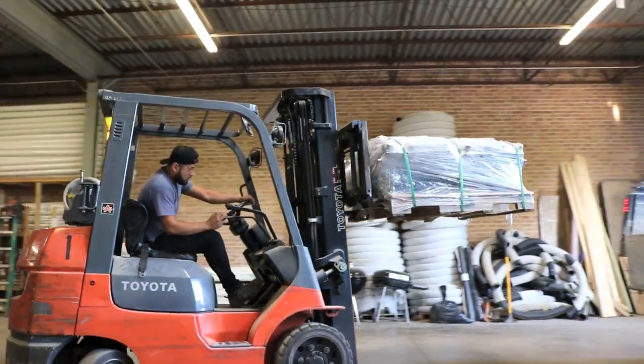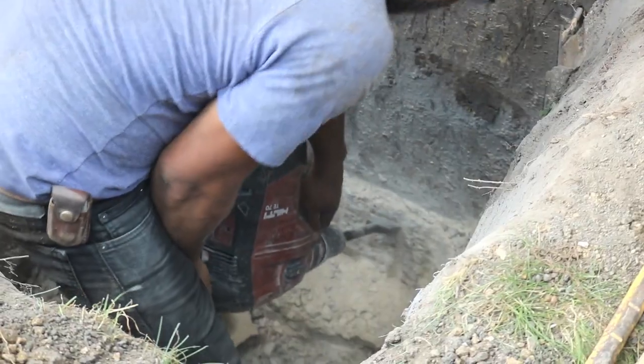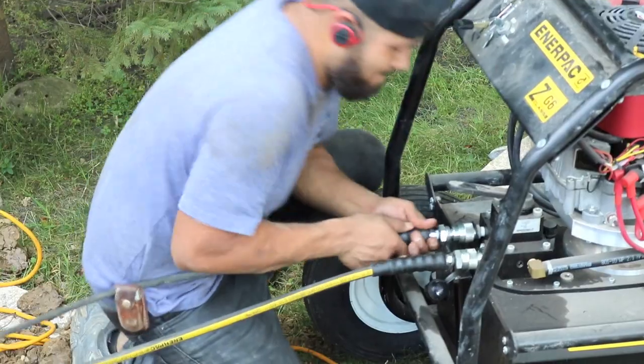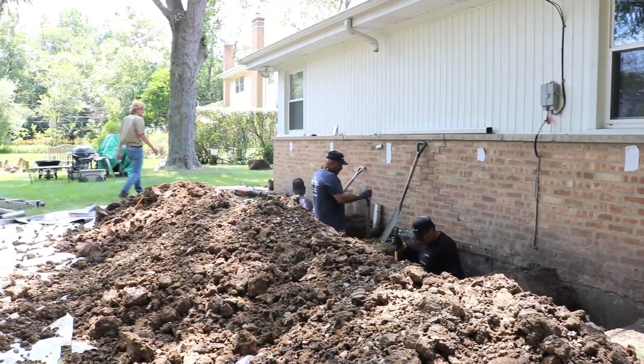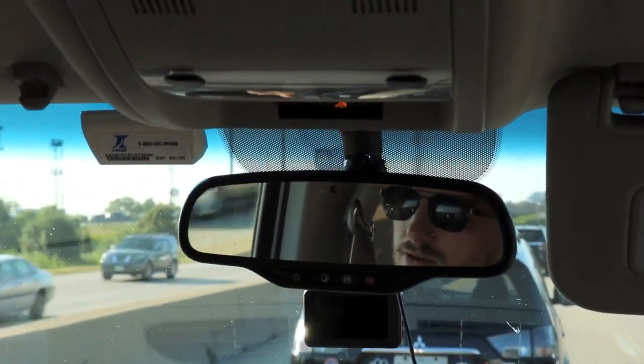Stilts underground. So we're going to have to dig out the foundation, get under it, attach some brackets, and drive these piers against the foundation with a hydraulic press in order to get them to some supportive strata. If this house doesn't get stabilized, continual foundation settlement is going to cause continual damage.